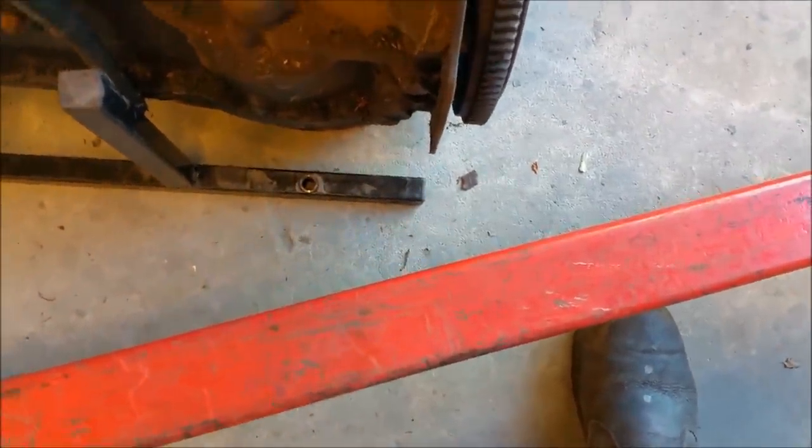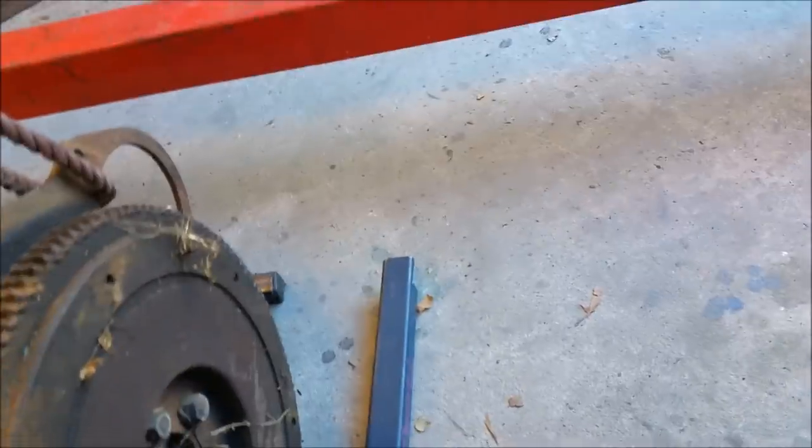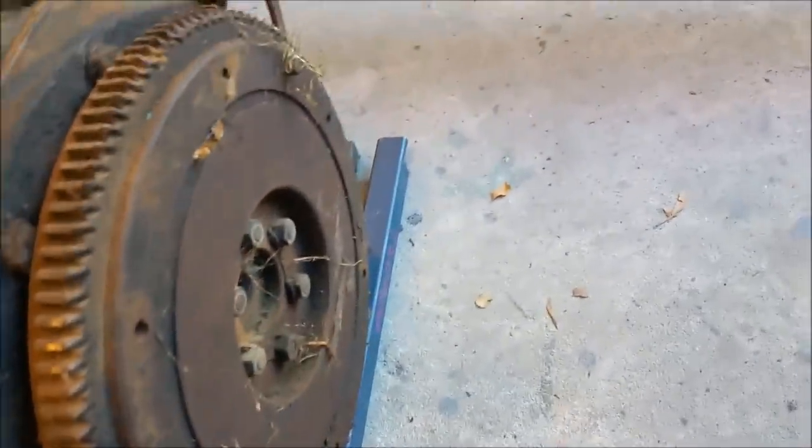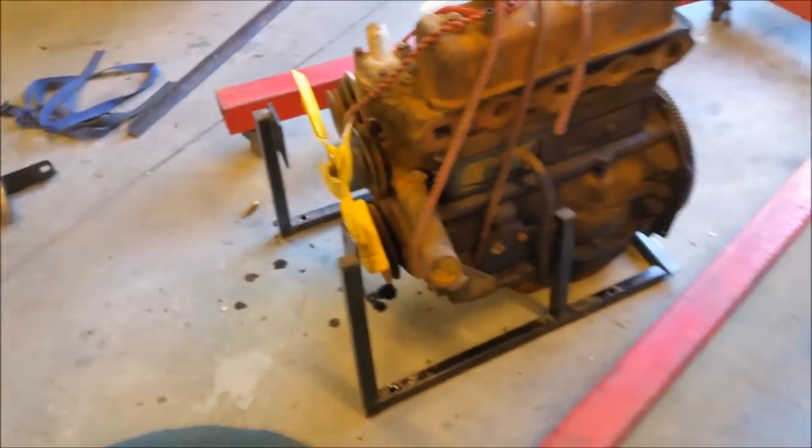But I reckon, looking at that, the best way to do it is just to get this stuff, which I've channeled out, and stick across the back at 400 width. So I've narrowed it 50 mil. That'll just sit over the top of that. So I might do that first. Actually, I might go and cut these bits off first. It's going to make it easier to negotiate, and then we'll weld it up.